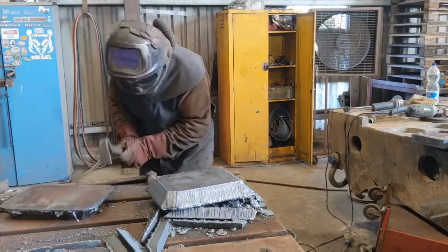So yeah, we'll take a look at some of the materials used, for a laugh. Surprisingly, we only have 11 rolls of wire, one on the machine. 11 rolls of 1.2 wire burned. We have 5 bottles of oxygen, because the first cap was off, obviously. So 5 bottles of oxygen, mainly for preheat and then some cutting. We have 2 large bottles of propane used in the preheating.